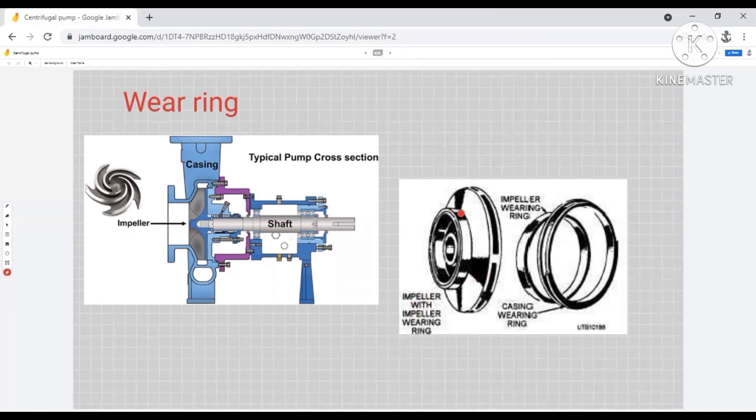Another problem in centrifugal pumps is that water enters the suction eye of the impeller, moves to the periphery at the high pressure side, and can then come back from the high pressure side to the eye of the impeller — then flow back to the periphery of the volute casing again. This short circuiting causes the efficiency of the pump to drop, because not all of the water taken in at suction will be delivered at the discharge side. To avoid this, we can also install a wearing ring at the casing — just a ring that does not touch the impeller but leaves a clearance, which prevents the water from coming back to the suction side.